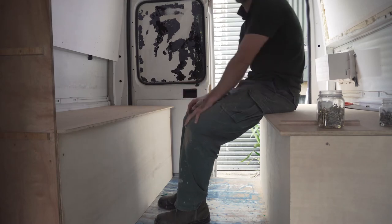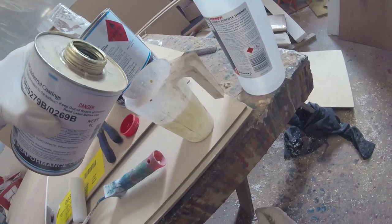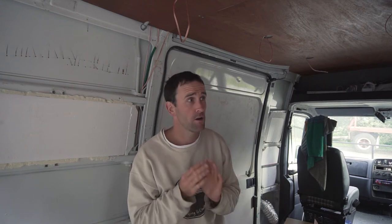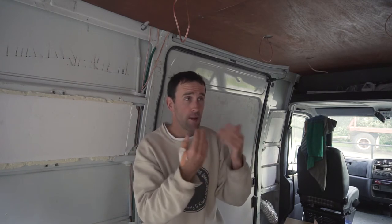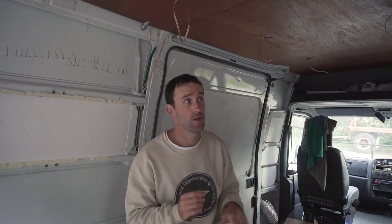For protecting all the panels, I'm using a two-pot varnish called Caprothane — it's a pretty serious varnish. All the white paneling you see is 4mm marine ply with just a primer — it'll be a sanded finish, not glossy. The side covering the actual wall backing has just got a coat on it to help protect against mold and moisture.